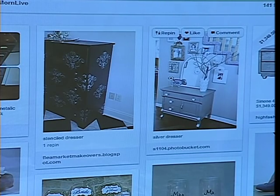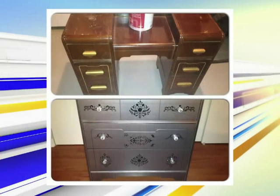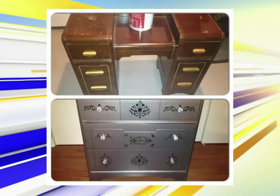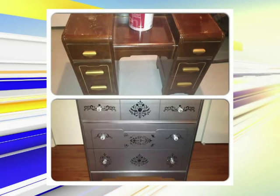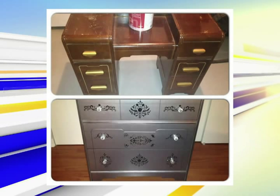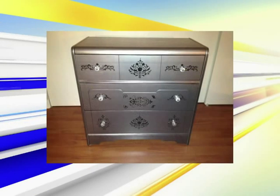It's not hard at all. What you want to do first — because it's an antique — there was some old paint and stain on it, so you have to sand it pretty thoroughly. You want to sand the entire dresser; that's really the elbow grease, that's the hard part. Do yourself a favor and buy yourself a little mouse sander — works wonders. I also took off the knobs because they were very old-fashioned and gold, and they didn't match the look I was going for.